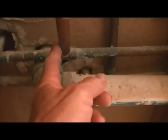They ran this soft copper — even though it's half inch, it's a different size with a thicker inside diameter than normal copper, so anytime I see soft copper I kind of cringe because it's not always easy to sweat. I'm going to cap off the soft copper the same as they capped off these lines, and reuse these lines — this will be the cold side, this will be the hot side. I'll just run the hot side over to this side of the stud, bend the cold side over, and when I put the new fixture in it'll go right there.